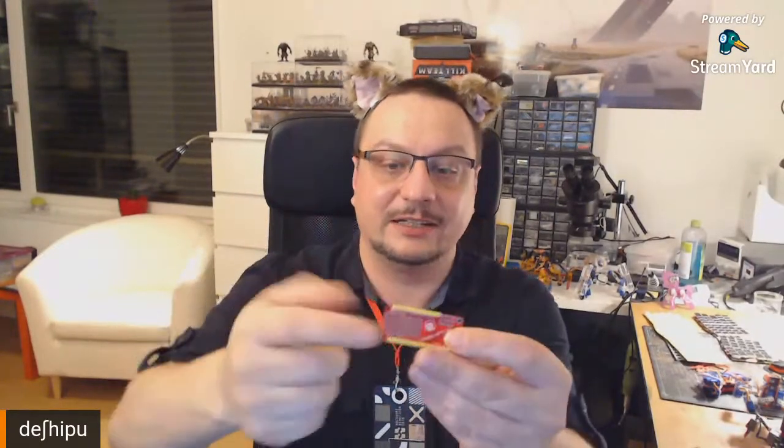And I included a lot of prototyping area on it because there was so much space left. And I just remapped the pins so that they have at least the same functions like an original Feather, but I used all of the pins. So the firmware for it, I actually use the same firmware as in the keyboards because it breaks out all the pins. So I can use all the pins from the chip. That's awesome. That's great.